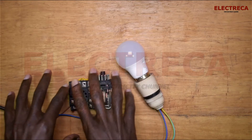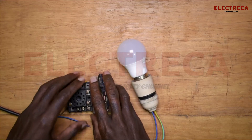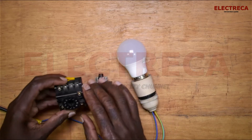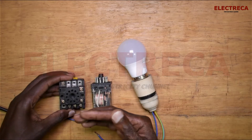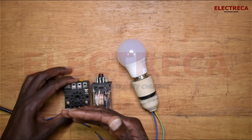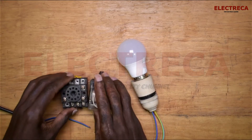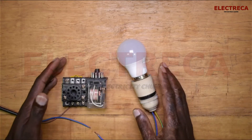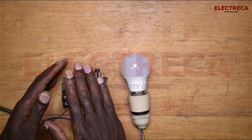So that's what we are going to demonstrate here. We are going to use a relay, because a relay is a switch that can switch between two positions. It can close from normally open to normally closed. That's why we want to use this one — it will be able to switch from main to our emergency light.